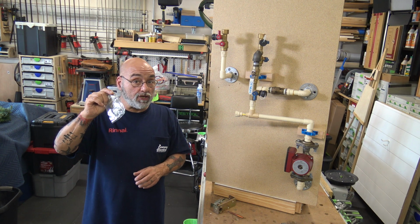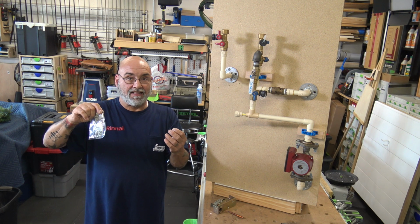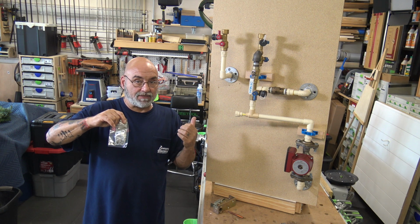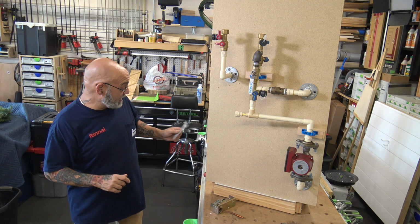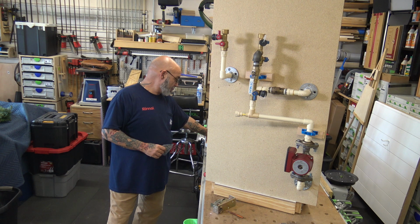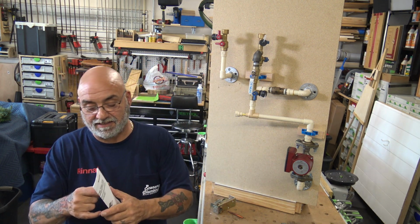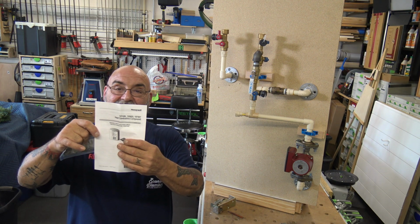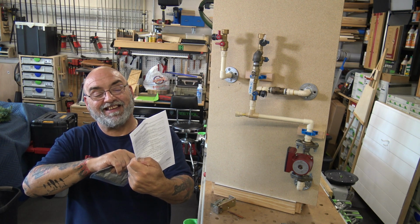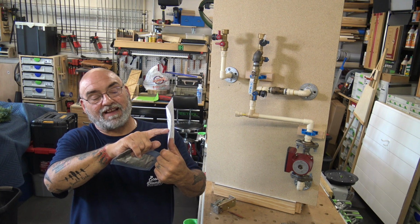And it's very important to use it, because what it does is it enhances the well to make it absorb the heat out of the water to make that aquastat work better. Okay? And there is actually a material safety data sheet that comes inside of the actual box. So it's heat conductive compound.